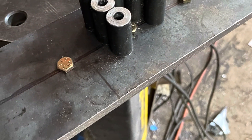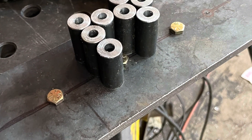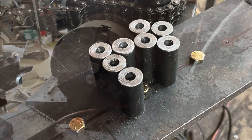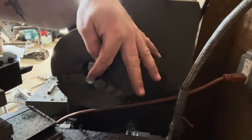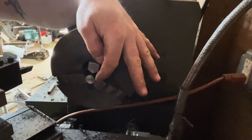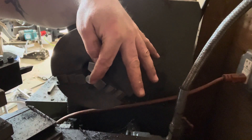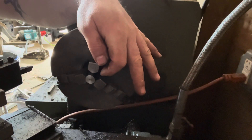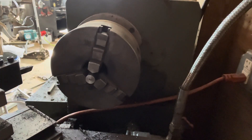Next we machined some spacers that are the thickness of the two thrusts for the bushings as well as the thickness of the gear, allowing us to clamp everything together and maintain equal spacing. We cut the spacers down on the bandsaw, then faced them in the lathe to an inch and a half within about a thousandth. We made eight of them so we have one extra just in case. Now I've turned the center and I'm boring it to just over a quarter inch, so we'll have spacers with equal tension on our part.